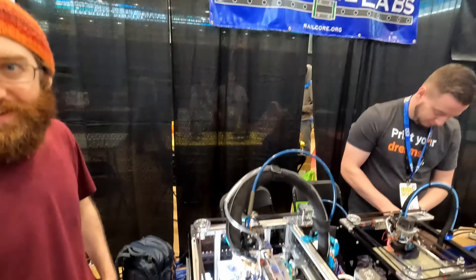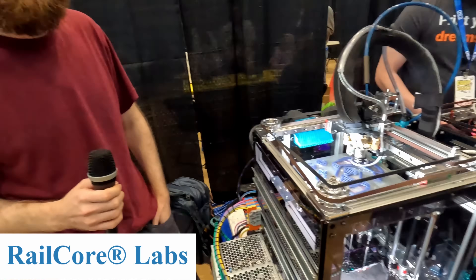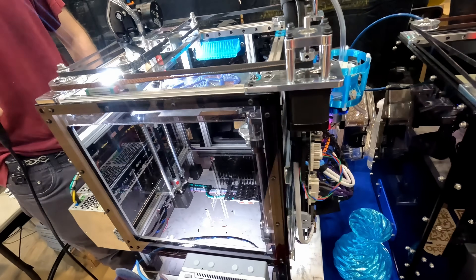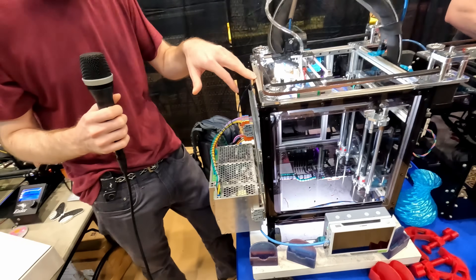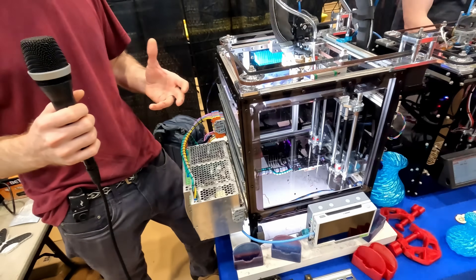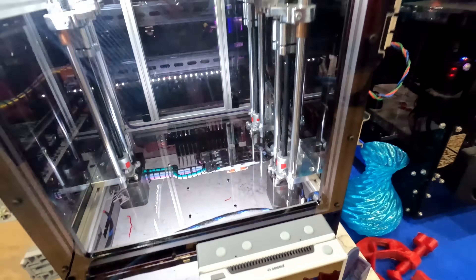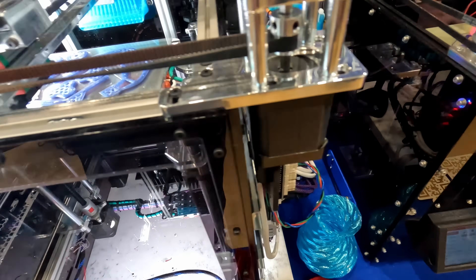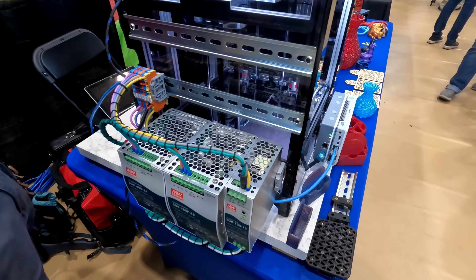So we are at Railcore Labs, and this is a Railcore Mini, but compared to the stock one, this is a little balling. I started this crazy project right when they released it, about eight months ago — I'm the first community member to build one of the Railcore Minis. I really wanted this to be a long-term experimental platform where I could make fast changes — going to NEMA 23s, servos, encoders. I've got three different power supplies on the back and I wanted to go all DIN rail, which allows me to switch things out very quickly.